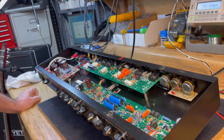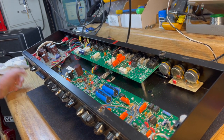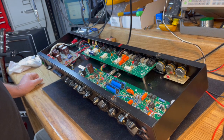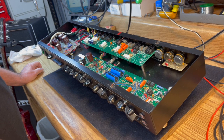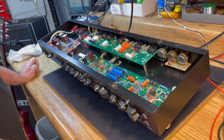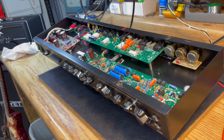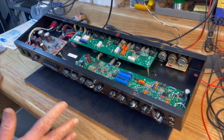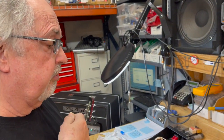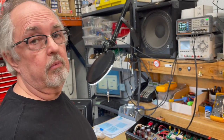They're also made with improved materials, and the quality is improving. So that means they get smaller, and it's okay for them to be smaller because they perform well even though they're physically smaller. And had the axials kind of been the caps of choice during the VHT era for the most part? We actually started the transition away from axials in 2001 or 2002 in the power amp specifically, just because the cost was skyrocketing to get really good ones. And they use up a lot of real estate.